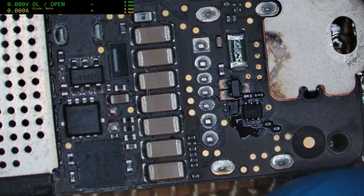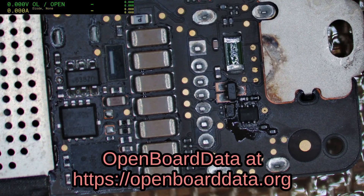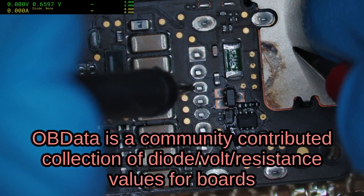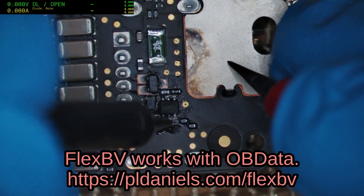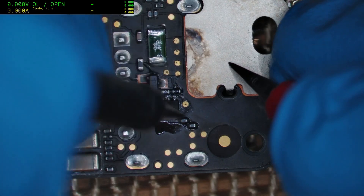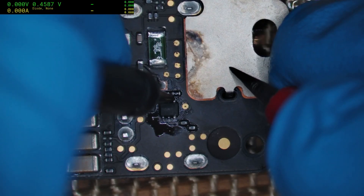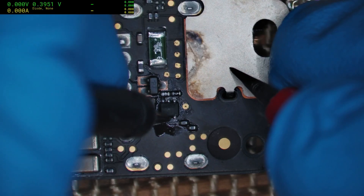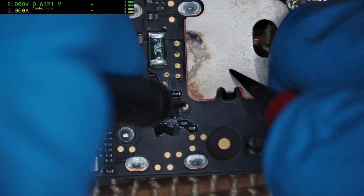Even though I've measured diode mode on here and they are, according to OpenBoardData, correct — about 0.67 — we'll demonstrate that here. We're getting 0.65, 0.65 on the clocking data coming in. After the shifter it should be about 0.6. Yeah, 0.38 is about right, 0.42, 0.45 — that's fine. 0.38 — yep.